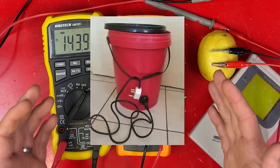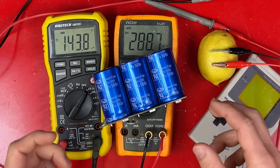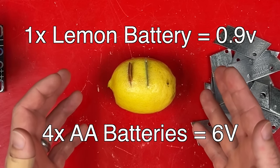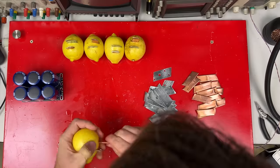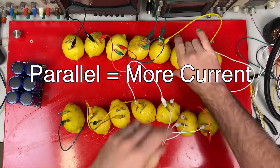This is a capacitor bank. It's kind of like a bucket for electricity — you can drip power into it really slowly and then tip it out as fast as you need to later. Each lemon battery is about 0.9 volts, and the four double A batteries the Gameboy is supposed to run on equals 6 volts. If we want 6 volts out of lemon batteries we need 7 lemons. But because lemons are such terrible batteries I'm going to use 14 lemons — two banks in parallel. Ready to go.